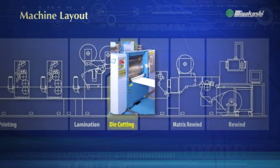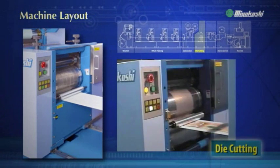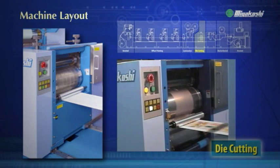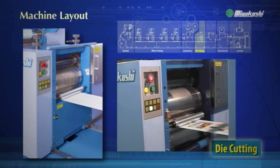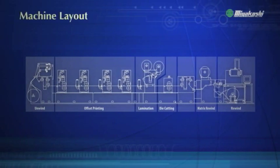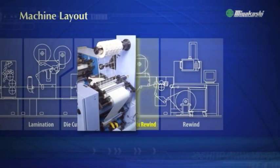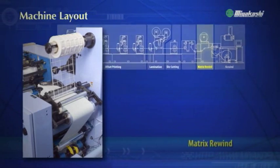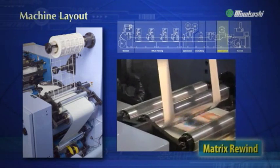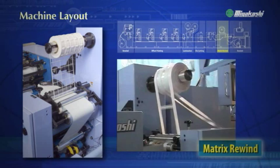This is the variable die cutting unit with a magnetic cylinder. Job changes are easily carried out by simply changing the flexible dies. It's very useful for short-run jobs. After die cutting, this matrix rewind unit winds the unnecessary parts of the self-adhesive paper. Thanks to the shaft drive system, even narrow-width waste can be stably wound up.